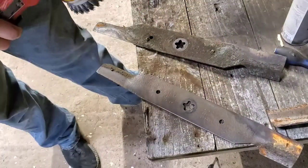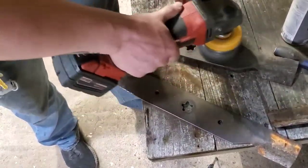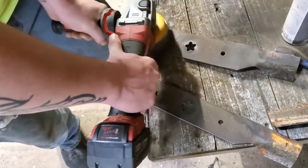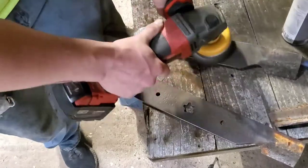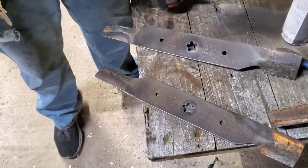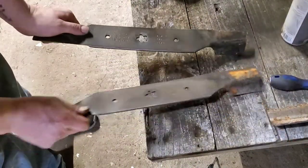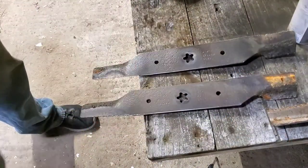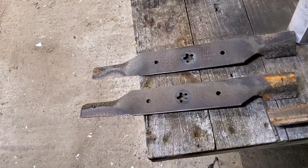That time it stopped a lot slower because I kept the trigger compressed to keep the brake off. Now that we got that done, we're gonna get our tape measure, measure both of these to length, and while we have the cutting wheel going we're gonna go ahead and cut our three by three angle iron as well, so that way we have all our materials prepped and ready.